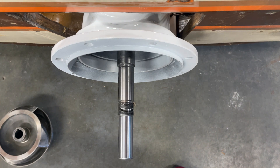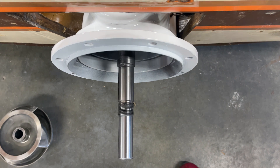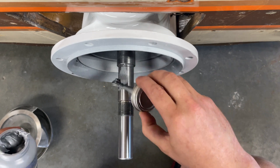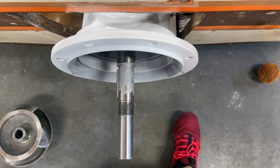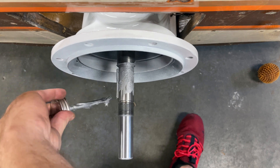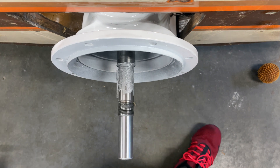It was a good solution. I'm going to set the keyway in and hit the top of that with some anti-seize, then slide the impeller on. Even though I have a lock nut for the impeller, I'm going to put Loctite 242 on there — mainly to prevent corrosion, since I don't want water getting in between that nut and shaft. I'll get some Loctite on the nut as well, then put our socket on and get this thing torqued.